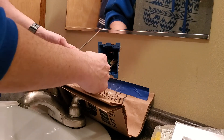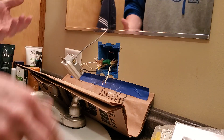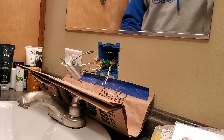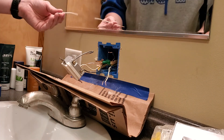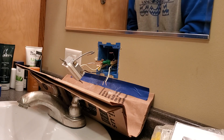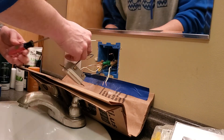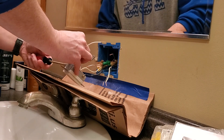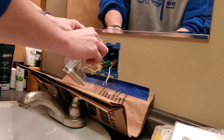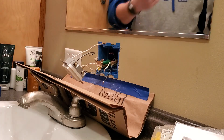Whenever I shove this all back in the box, I don't want that hot wire touching any grounds or any returns, because then we're arc welding. I like for fires in my house to stay inside the fireplace — I don't need them inside the electrical box. I'm going for the second one on the silver side — this white wire. I'll give it a little trim too since it's a little long. There we go — I've got a hot and a return.